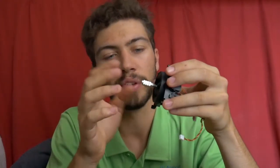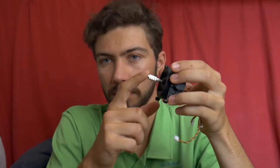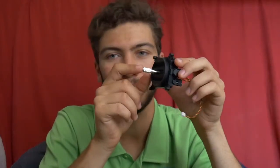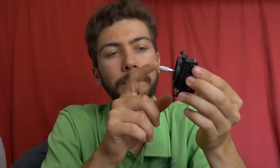When you move the stick it makes a different current to determine position. Because we move it a lot, we scratch the carbon surface a lot, and at some point it's too worn and the gimbal becomes inaccurate. One of my old gimbals was 15% off — meaning I had to move the stick 15% before it detected movement. That's why I upgraded to Hall sensor gimbals.